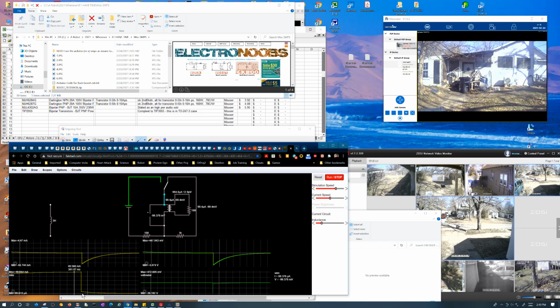But at any rate, you can see what the current did too. The current started at 40 milliamps here, well, it starts out at 45 milliamps here, so it is kind of doing what I thought it would do. Because remember, 50 milliamps was the actual charge curve current limit. So this 4 milliamps is what's flowing through this 1K resistor. It's getting like 10% of the current because it's a 10 times bigger impedance, in effect, than it was charged by.